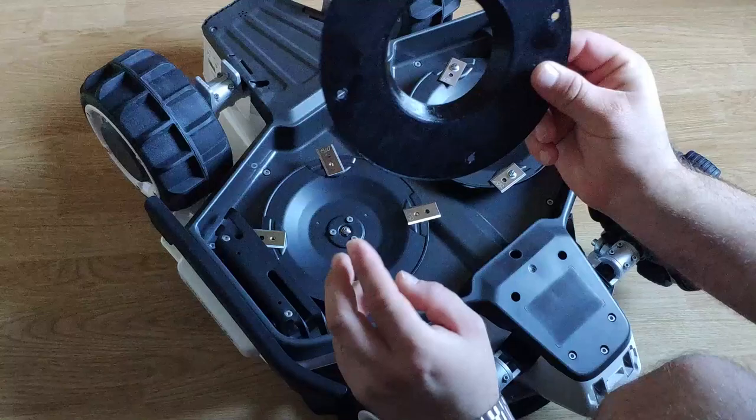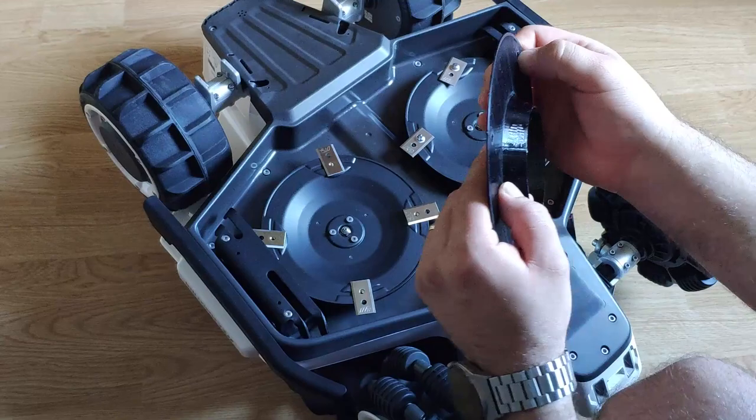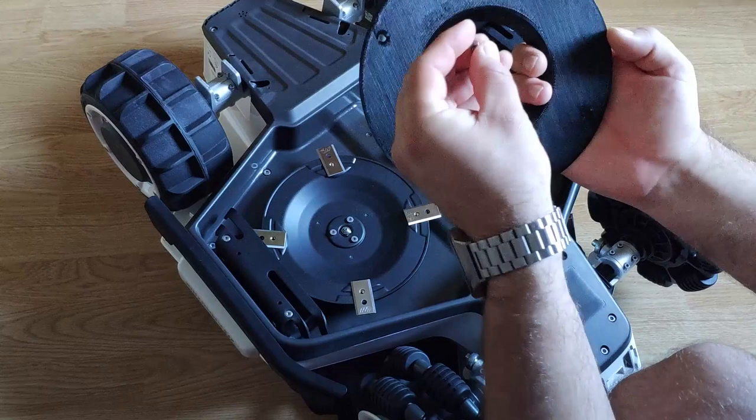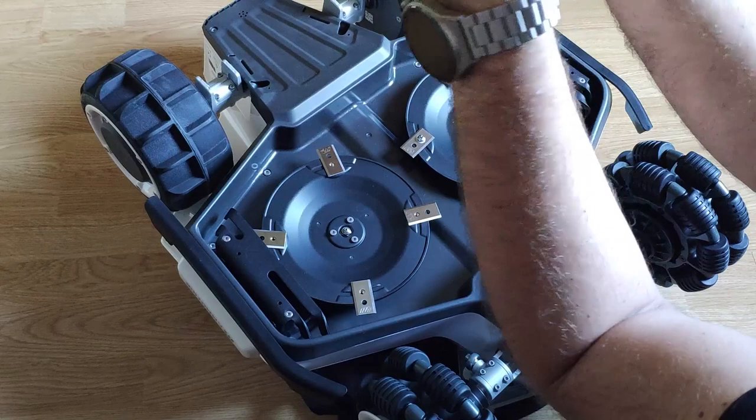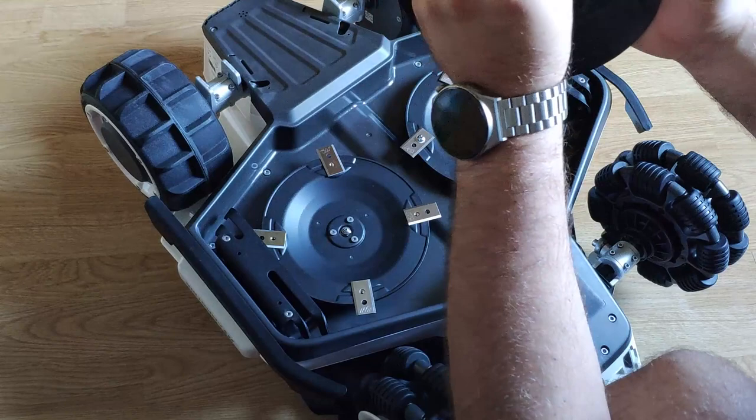Take the cover. There must be a nice flat finish surface on both sides — no extra plastic. You can check the holes with the screw: it must go through the hole, and the flat part must come out on all four holes.